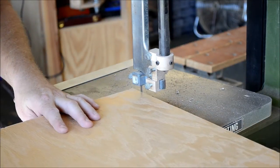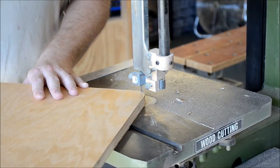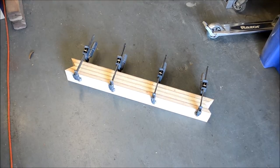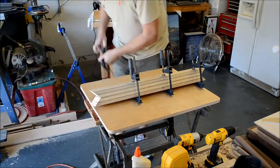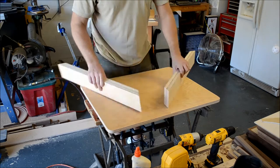Then I manhandled it at the band saw to cut the rounds. The maple block I shaped to replace the broken cast iron one is working out just peachy. Then I cut and glued up the fences. These will meet at a 45-degree miter on the saw kerf.